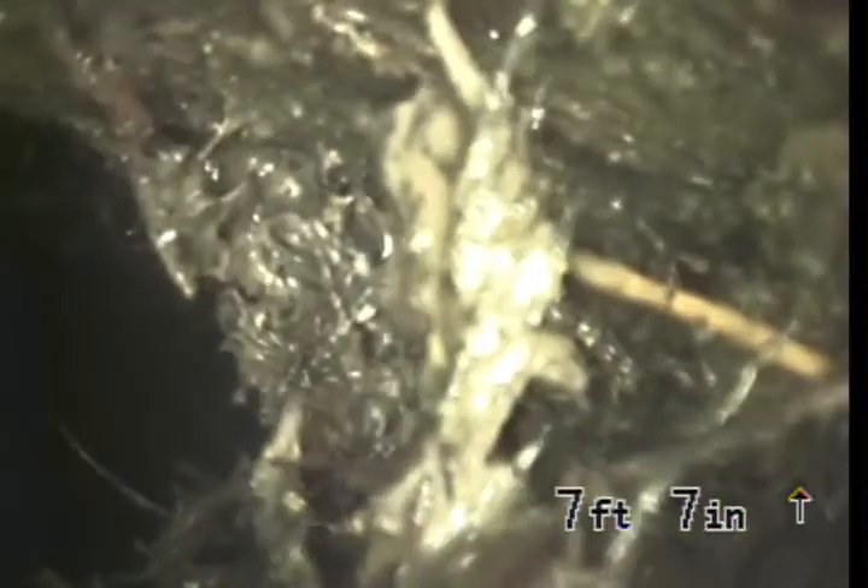And then as I come even further back towards us, it's another huge root intrusion that's about almost 90% clogged. This was clogged even more when I got here — there was water. My camera was able to bore a small hole to get through it, but I was having problems. And then I got to this one, and that's just like a brick wall for me.